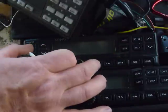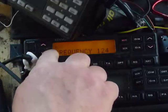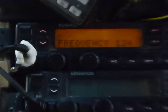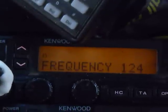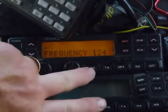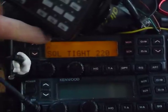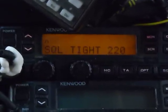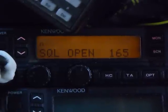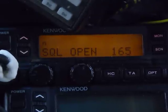Turn it off. Turn it on. Group up. One click, and an N should show up. Let me zoom in on that N. And once again, the settings: go PF1 twice — click, click — tight squelch to 220. Advance up, open squelch 165. Don't change any other values, and this will improve your squelch window and make the radio work properly.